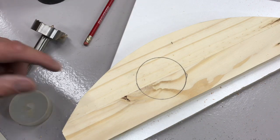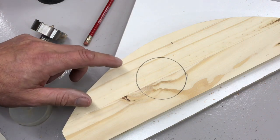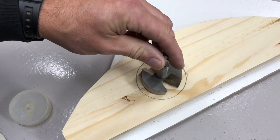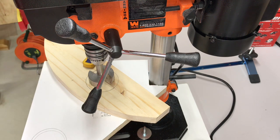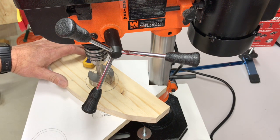The wheels are turning — I'm not going to use particle board, it's too thin. I traced out the outside shape and I'll use the scroll saw to cut a bevel so it acts like a cork and seats in the hole better. I have a two-and-an-eighth inch bit, so I'll drill that first, then sand or rasp the inside until the hose fits snugly. Once I'm happy with that I'll cut the outside at an angle. I'm setting up the little bench-top drill press — this is the biggest hole I've ever drilled with it, so let's find out together.